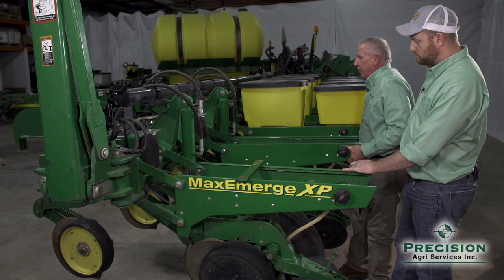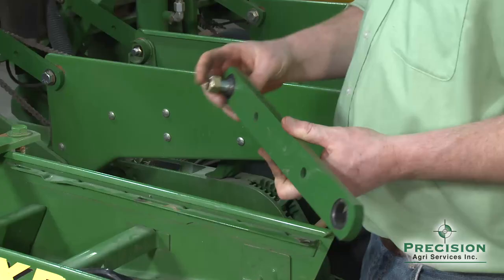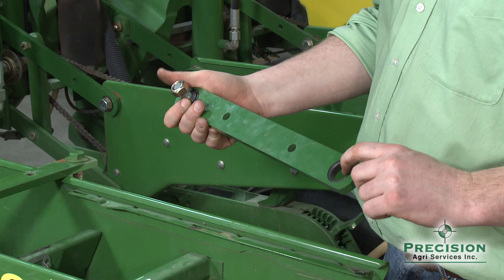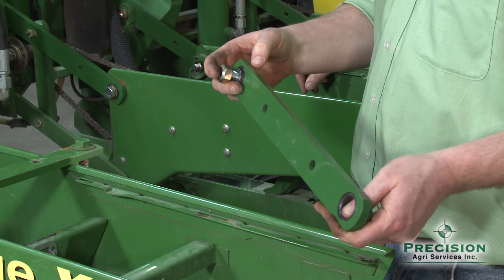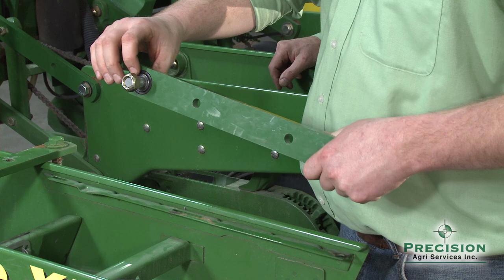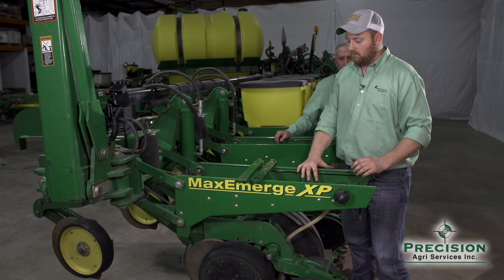The upper arm we chose for this row unit is an aftermarket option, not OEM John Deere — it's made by GBGI. The uniqueness of this arm is a two-bushing system. On the outer arm you have your standard stamped steel, a spring bushing on the inner part of the hole, and your standard bushing on the inside to ride on. The outer spring bushing is harder steel than the inner bushing. Over time, only the inner bushing wears, preventing the egg-shaped arm hole we had to replace here. These arms show much better wear and tear over time.